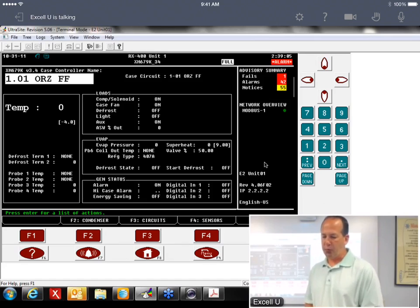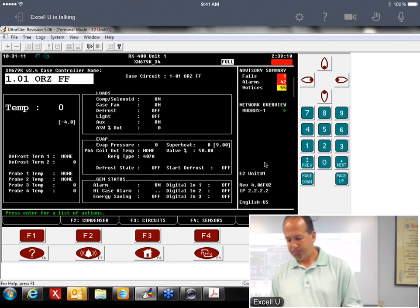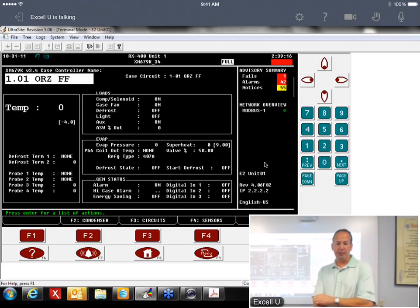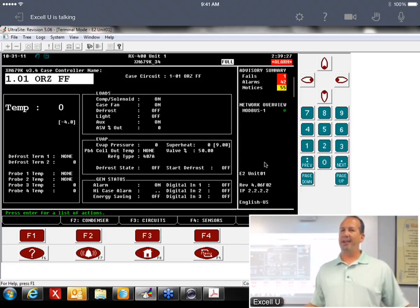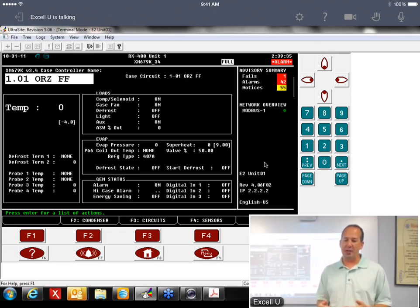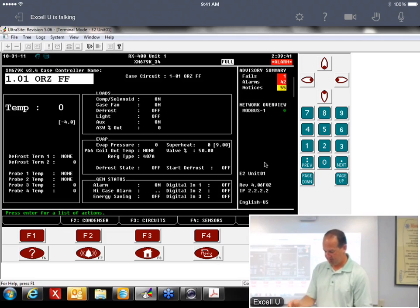I'll hit some of the more popular ones. We already hit the case lights blinking off. That's in here. One of them I've had a few calls on actually is the XM circuit says that it's in defrost, and you can actually go down to the device itself and it's in refrigeration. You're like, how the hell does that work? Well, what has happened is the device and the XM circuit have gotten out of sync. So what you would do is delete the association to those two. And I see that's in here. We'll walk through that real quick.